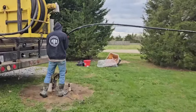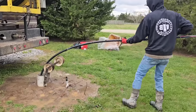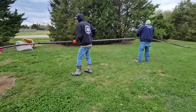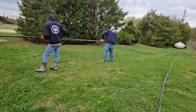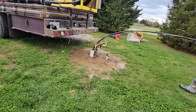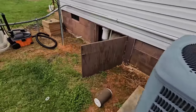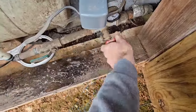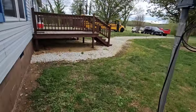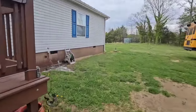Time to put the pump back in. When we hook it up, we'll let it flow for a little bit and make sure it all works correctly. Then we'll go inside and check its pressure. It ought to be a whole lot better now - got a filter that'll flow five times the amount of water than the old one. But a plugged-up filter and a dry well are two different things. We've got the well pump in - let's go ahead and turn it on. I hear it flowing over here, that's a good thing. Let's go to the front and flow water out the front. We've got a storm upon us.